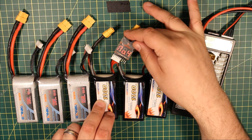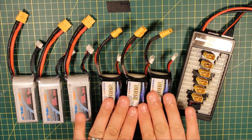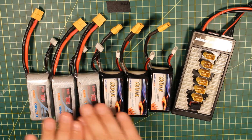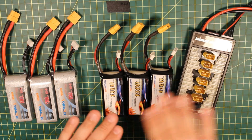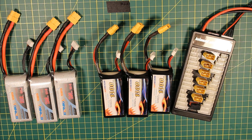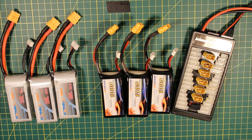You start to come unstuck if one of the cells is a lot lower or higher than the others, because when you plug all these in together you're effectively connecting the cells of these batteries together. So if you call them cells 1, 2, 3 and 4, you connect all of cell 1 for all 3 batteries together, then all of cell 2, then all of cell 3. The cells need to be approximately the same voltage because they'll try to balance out, and if there's too much of a difference, the batteries with higher voltage drain into the batteries with lower voltage at a very fast rate — because there's very little resistance and it's only one cell doing that, which can upset the lot. Firstly, the one battery is being charged at way higher than 1C, and secondly, the other battery is having one cell discharge at a very fast rate.